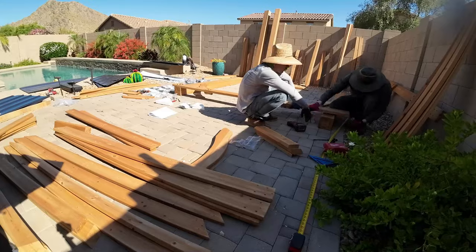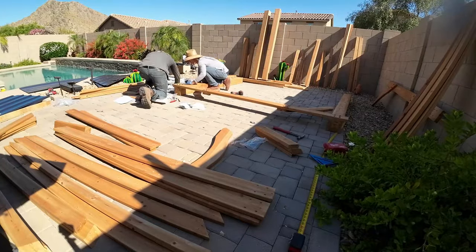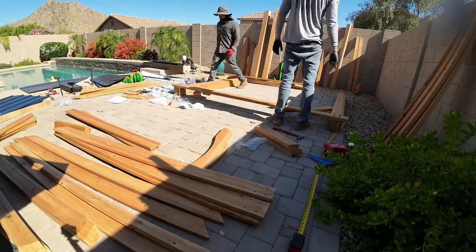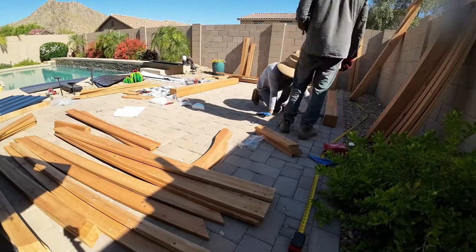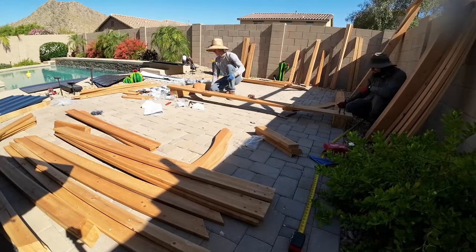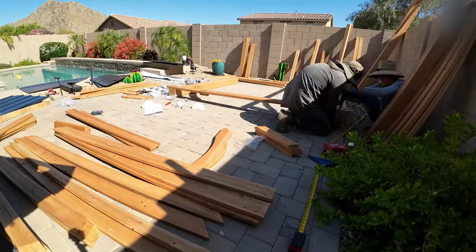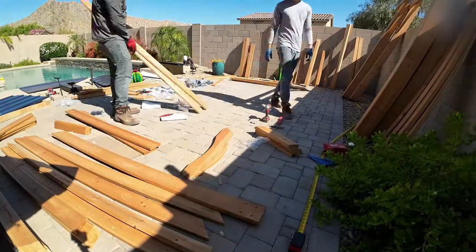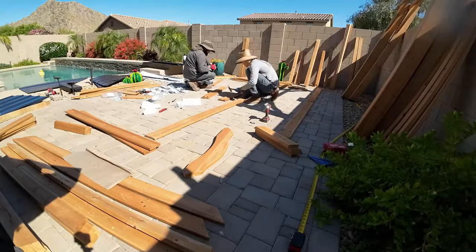I tried doing it, but I did not sort it from small to big, and just having everything everywhere throughout the entire process, I can honestly say it cost me at least an extra hour just walking around trying to find all the little parts. Once you have everything out and organized as best as you can, put all the lag bolts together, all the washers together, all the nuts together, all the screws together. The instructions for this gazebo are in two parts — part one is the post, so we're getting all the joists and side joists together and screwing everything together.